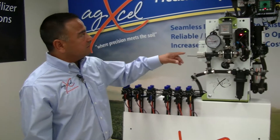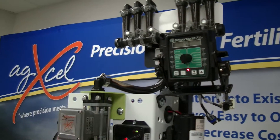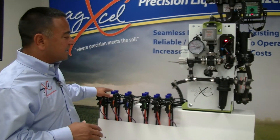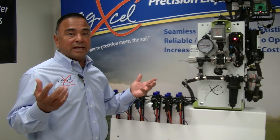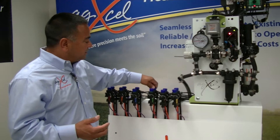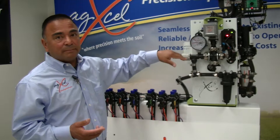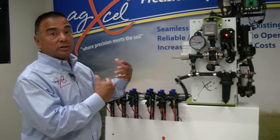Right now we're getting approximately five gallons to the acre on our setup. Our pressure is running right at about 12 to 14 psi, and I currently have both tubes running — both are open. What this would simulate is, for example, first thing in the morning when you're getting ready to plant: your liquids are a lot heavier, a lot thicker, it's colder. You'd open up both valves to keep your pressure in the proper range. We typically like to see anywhere between 10 to 20 psi — up to 25 to 30 is acceptable — because it helps all the electronics run a lot cooler and prevents overheating of electronic components.